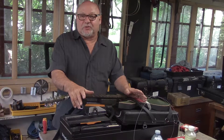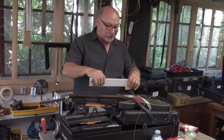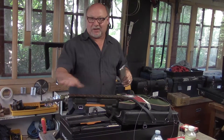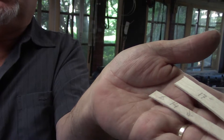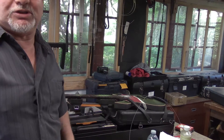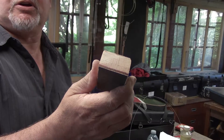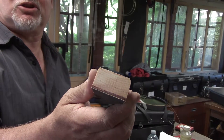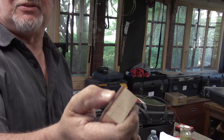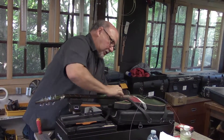Like you've seen in the previous Strat video, this is done in pretty short order. The real problem area is right at the neck junction — so we've got to take this down to get the neck nice and low. I've made up my radius gauge, a 17 and a 14. We're going to start at the top end because there's a bit of a hump at the neck-to-body junction. This is a small scrub block, narrower than the fingerboard — that's exactly what you want — because we want to take down the center portion of the fingerboard and reduce the radius. There's a slip of leather on there and that block easily flexes to that 17 inch radius.